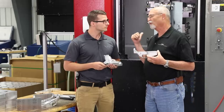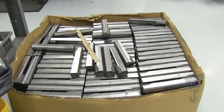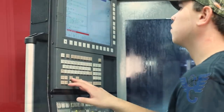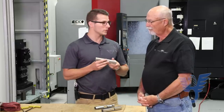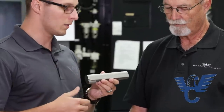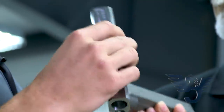I appreciate it, Brent. That's a pretty cool piece of kit right there. Absolutely. Brent, here we are at another machine. Tell me what we got and what's going on. All right, so we're at another horizontal. This is a little bit smaller, same horsepower, same spindle RPM, but we cut slides over here. We bring them in as raw forgings or shaped bar depending on the application. What we do here is the machine's a heavy hitter — we got a bunch of big drills and a bunch of roughing we got to get done. We take that and we pretty much get it all the way down to where all it needs is external cutting for whatever options we're putting on the slide.